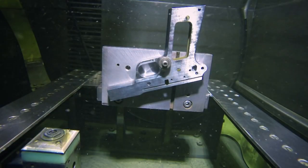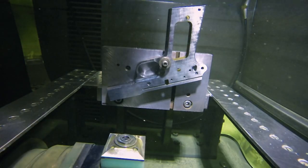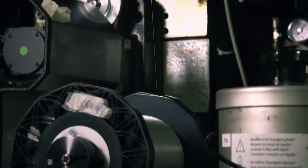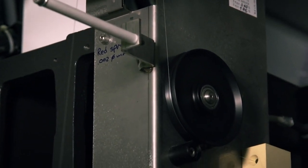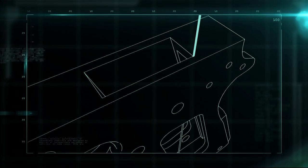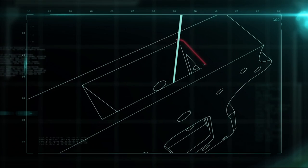The pistol body is again submerged in water, this time to conduct electricity. With both the metal and water electrically charged, intricate detailing is done using an EDM, or electric discharging machine. Stainless steel wire is charged with an electric current at 300 volts, then run through the magwell, carving fine details onto the steel surface by literally burning off metal particles.